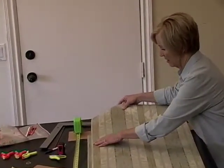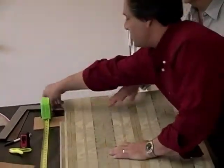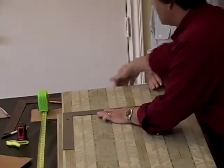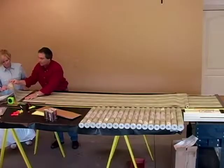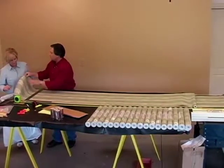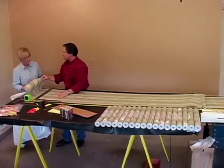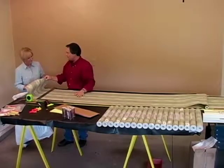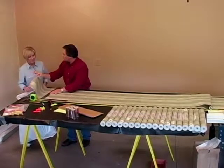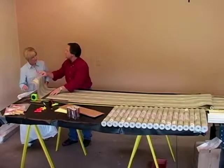Now, let's talk a little bit, since you've figured out that it didn't match, because we always have to match here. Taking the carpenter's square, again, line it up here. Now, you see this extra right here? This is what we call the waste. The waste is what would be coming down on top of our head when we hang wallpaper. Remember, Grandpa says it's easier to deal with wallpaper dry and flat than wet and vertical. And the reason is this is what would be making the paper fall off. So this we call selvage.